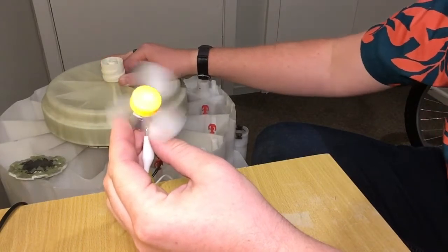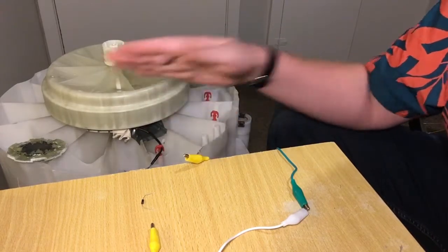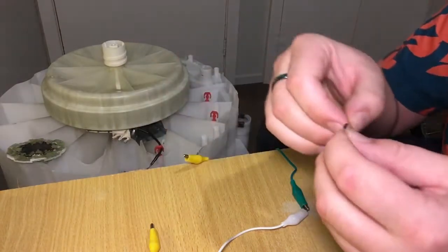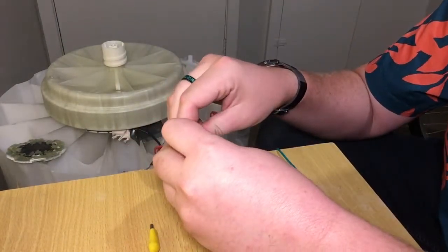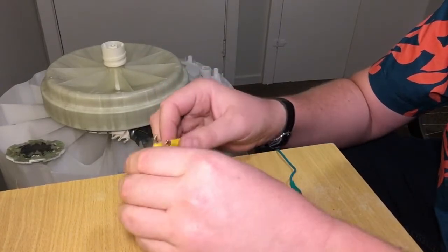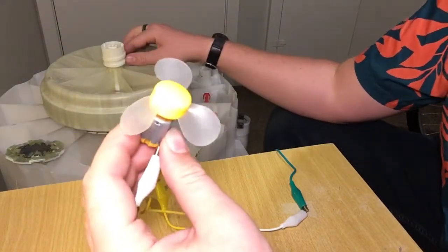Not very useful for me. Because this is an AC motor it's going to put out positive then negative, positive then negative. This is DC so we're going to need to put a diode. Very simple — just take one of the lines, clip it in, and this will only accept positive flow. The negative will just go in the bin, it doesn't go anywhere.